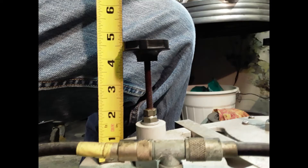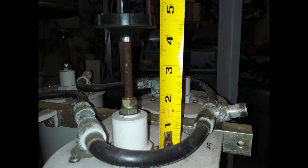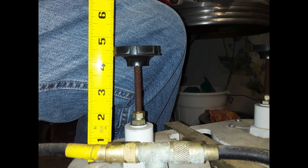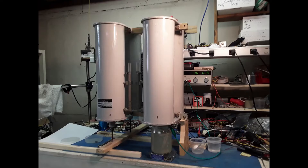Markings were made, measurements and a pile of photos were taken to document the duplexer in case things went south, so I have a reference to go back and restore it. The tuning knobs were removed from the bandpass adjusting screws and then the coax harness connections were covered over and the unit was sprayed down with a multi-purpose cleaner and then wiped down. I wire brushed the rusty screws to remove any loose material.